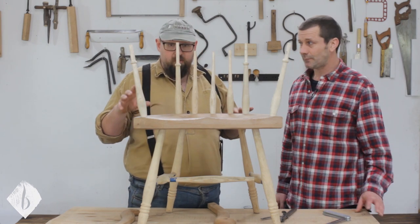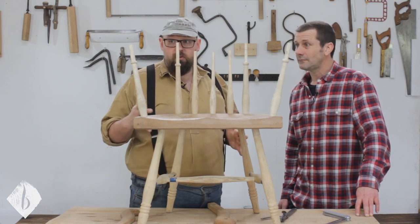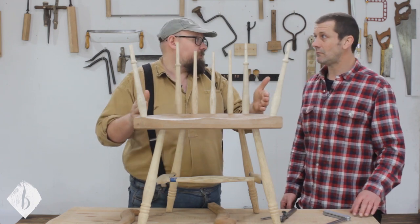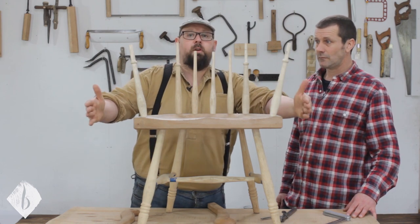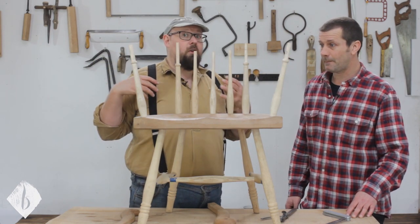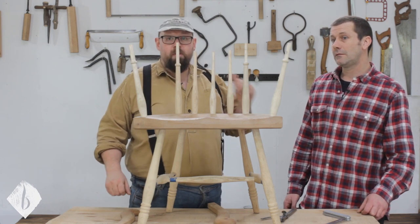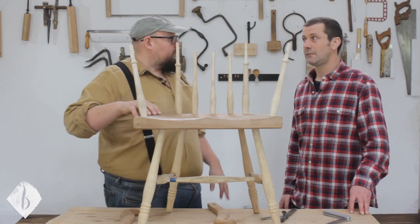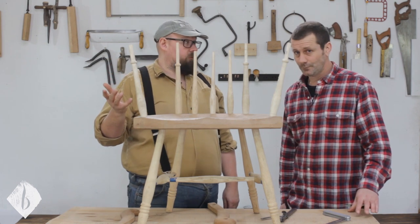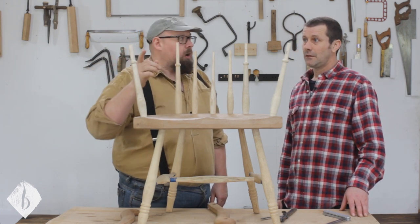This design is based on a very old chair that was even more rustic than ours. The splay we've got means you can use a smaller board. You do get armchairs with no splay where everything's straight, but they're made from a much bigger board — otherwise someone big can't get their thighs between the arms. There are lots of different options; this isn't necessarily the normal way to make a chair. Our undercarriage is pretty normal for a Windsor chair — almost a blank — so you could do all sorts, and you could even just leave it as a stool.